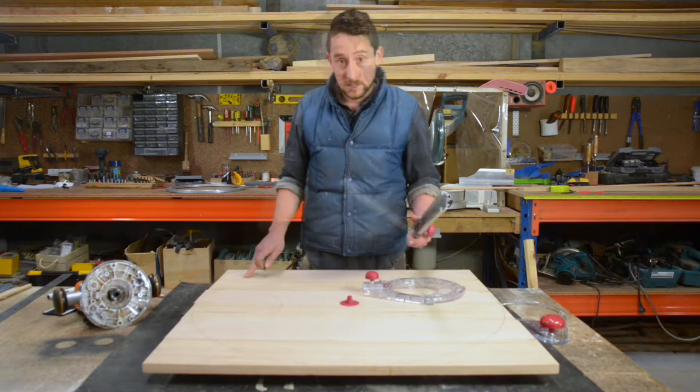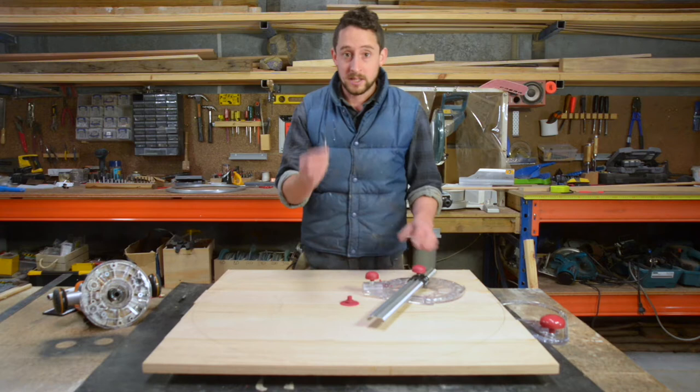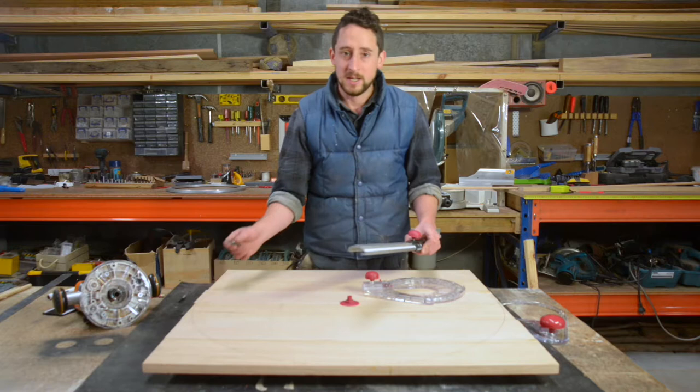For this Lazy Susan I really like to do this cut with a spiral upcut bit. I think the cut will be cleaner and a little bit faster. The disadvantage is I don't get the accuracy of the inside and outside cut measurement, so I'm just going to have to place that myself. It's actually really simple, but I just wanted to let you know that that is a feature which comes with it.